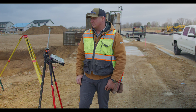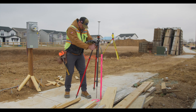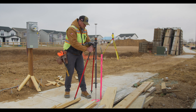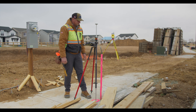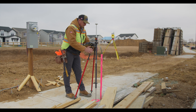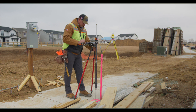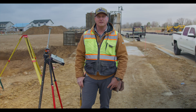One of the things that we like to do when we set up our Leica total station here is that we need to go ahead and use the survey stakes that are left prior to us coming in to do the job. We've worked with our surveyors and they take the survey stakes and they move those a long ways away from the foundation element, which gives us the opportunity to keep those stakes and not lose them through the excavation process. So when we pull up on a job like today, I have all four of my offset stakes in place and we're ready to go.